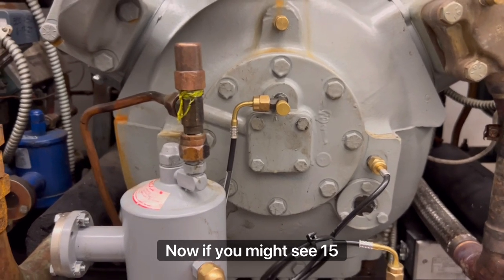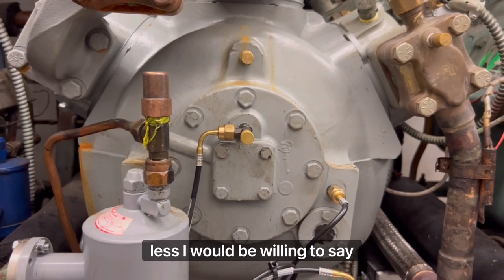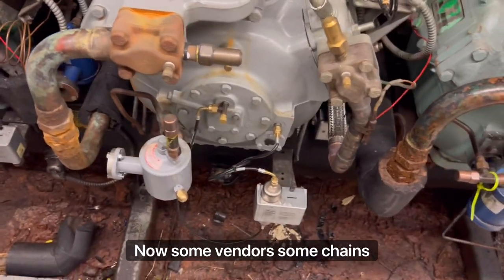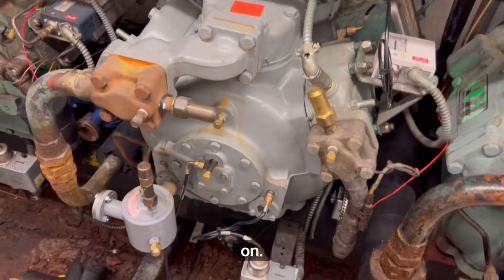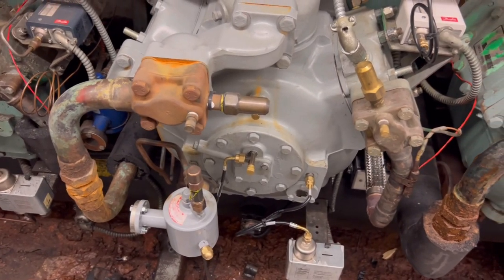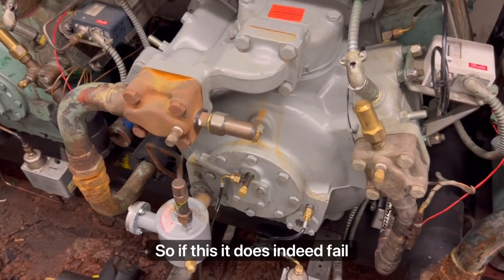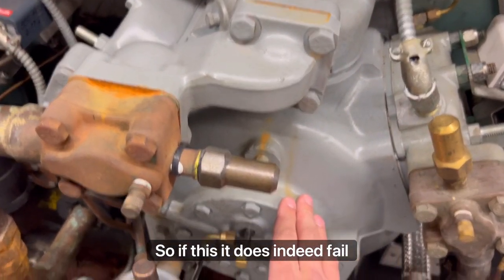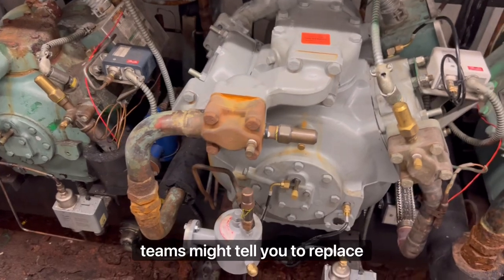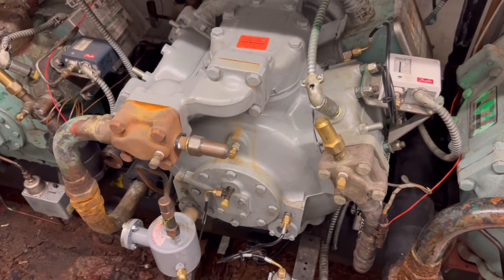You might see 15 PSI, you might see 17, you might see 20 or above. But if you are looking at 10 PSI or less, I would say that your oil pump on your compressor is probably bad. Some vendors and chains will tell you to go ahead and change oil pumps solely on the compressor. In my experience, I've heard a lot of bad things about just changing oil pumps — remanufactured, defective compressors. So you're better off just doing the whole entire compressor. If your oil pump is indeed not working right, you should go ahead and replace the compressor. But that's chain to chain — some chains might tell you to replace just the pump, some might tell you to change the compressor. That's how the oil system works.